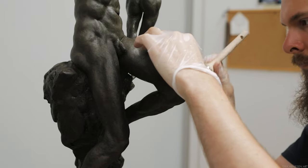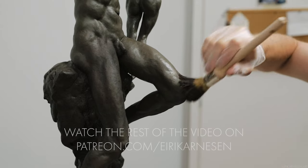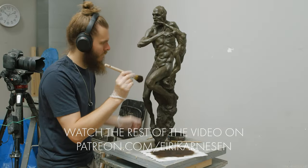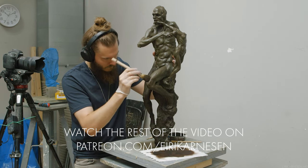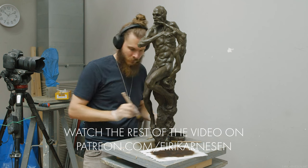On the surface, the wax will cool and firm up and create a protective surface. While certainly not extremely durable, it will be somewhat durable and definitely capable of being touched without coming off, though rubbing the surface with intent to remove the wax will still remove the wax and ruin the finish.